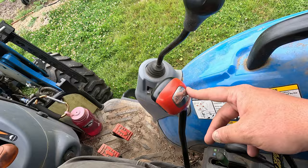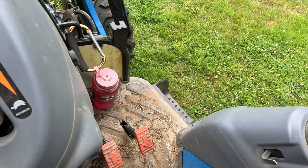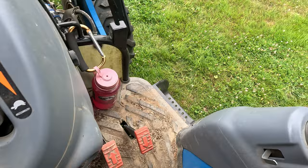Before you start your tractor, make sure your hand throttle is down. Make sure you are out of gear or at least in neutral. Make sure your brake is depressed. And make sure your PTO is in the off position. You also have to make sure your posterior is in the seat. There are safety switches on modern tractors that prevent you from starting them in unsafe conditions — like with your PTO turned on, your brake not engaged, or your butt not in the seat. A lot of them have transmission safety switches too, making sure the transmission is in neutral. In a manual transmission, make sure you are completely out of gear before starting.